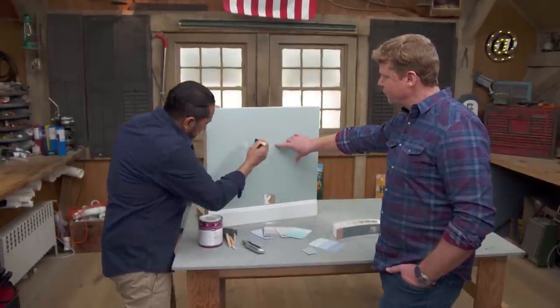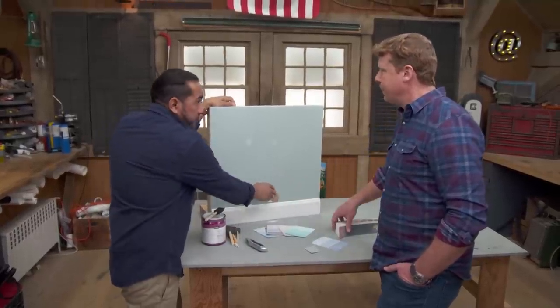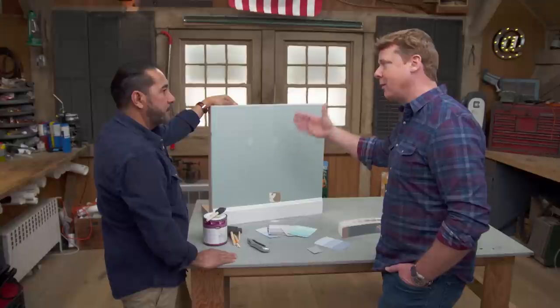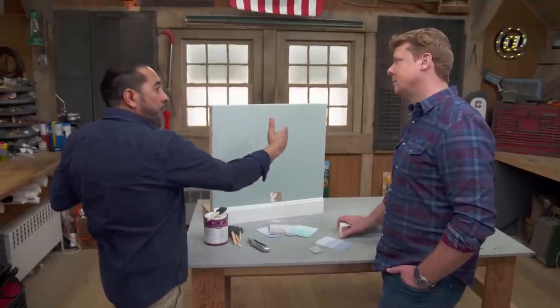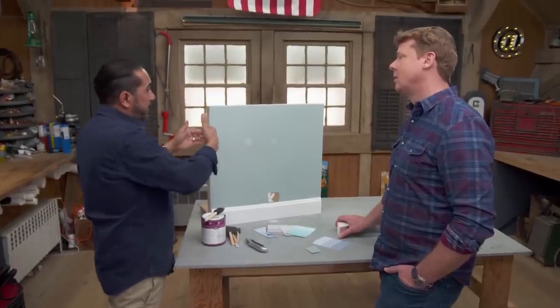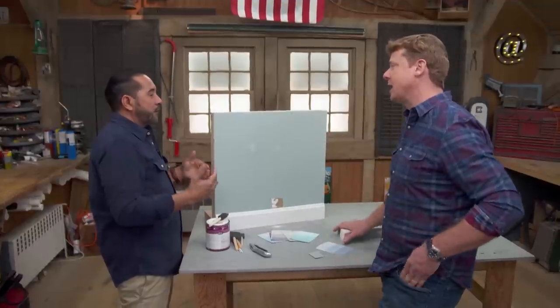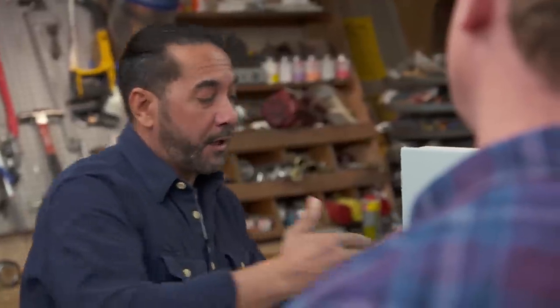That's sufficient for a couple of small nail holes, even for the repair where you peeled a piece of paper away. Let's say there's more damage — electricians moved some outlets around and now there are bigger holes. At what point are we repainting the entire wall? If it's bigger than this, we might as well paint the whole wall. It depends on the paint and how old the paint job was, and how much light is breaking into the room. The sun hits the wall and the colors fade, so we might as well paint this wall and the wall next to it.